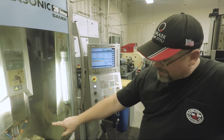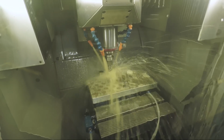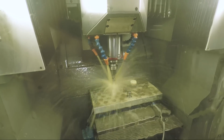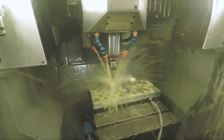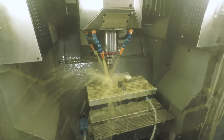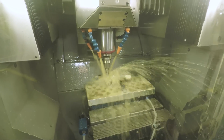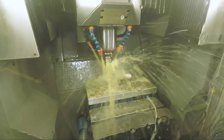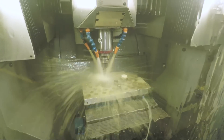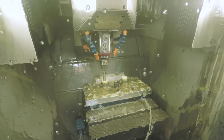Which means if you look at that holder, that tool holder in there, the red ring on the spindle nose is transferring energy to a magnet in the holder. And then the part that actually holds the tool in the bottom is oscillating ultrasonically, between 16 and 30,000 hertz. So it's kind of a chipping action. Really? So that's grinding, hollowing out a sphere.